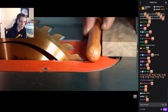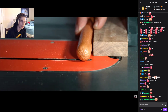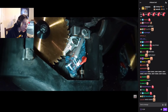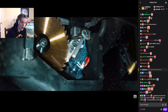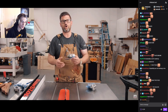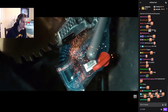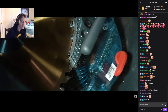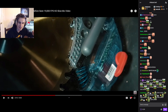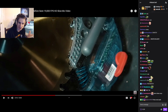When you have an activation, the blade has a current running through it at all times that is measured as a sine wave by the computer inside your saw. When you touch it, you actually lower the amplitude of that sine wave, which causes a chain reaction over a fraction of a second. The computer sends a charge of electricity through a fuse wire holding a spring under tension, which then fires an aluminum brake — what I like to call a crumple zone — into the blade. It's designed like the crumple zones in cars, with portions designed to absorb impact and compress. There's actually a small explosion involved — similar to how airbags use a charge — it's the fastest way to do it.